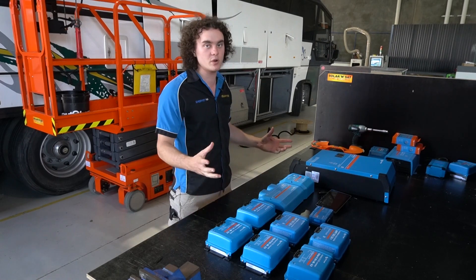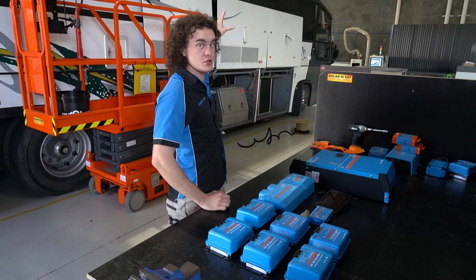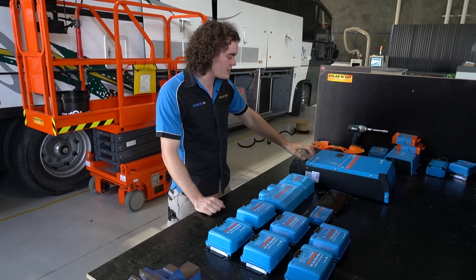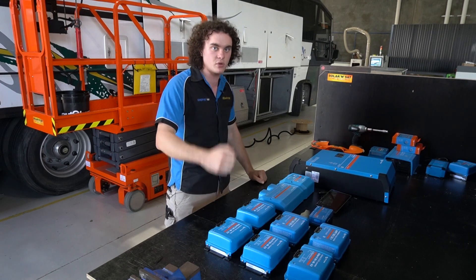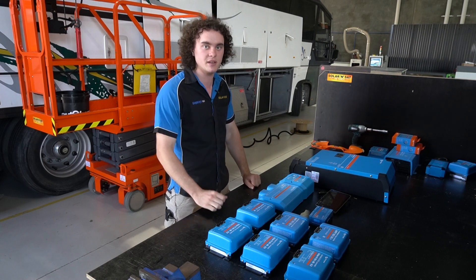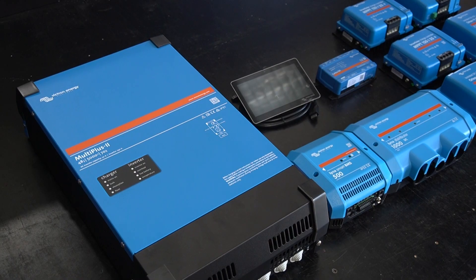There are a few reasons we choose to go 48-volt or 24 as opposed to 12. One of the big things is when you're working on huge setups like this, voltage drop is always an enemy. By going 48-volt, you can effectively use four times smaller cable to carry the same amount of power. So we can use a lot less copper to achieve the same thing and help avoid a lot of voltage drop that would otherwise be unavoidable in a lower voltage system.